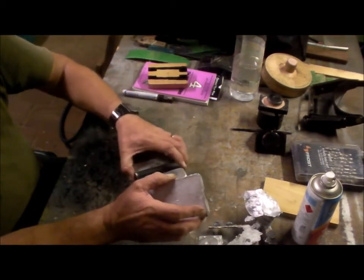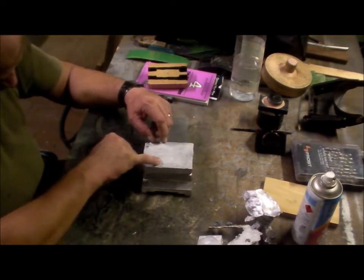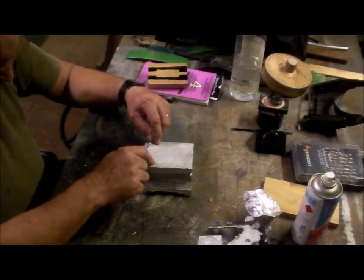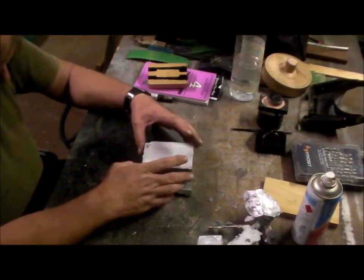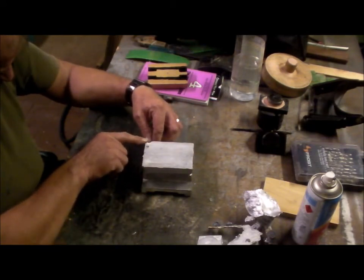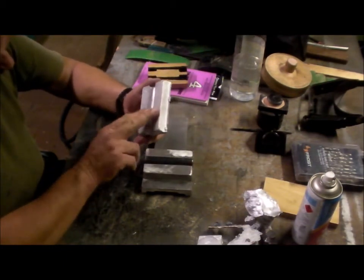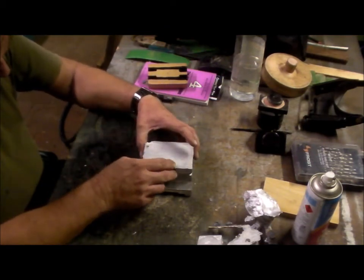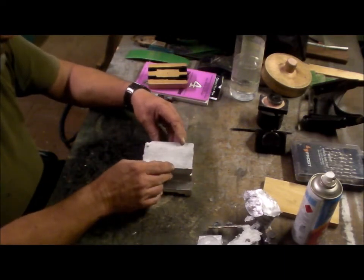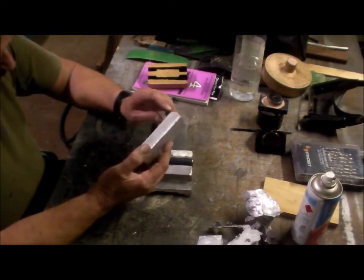And this piece — that's the bearing cap. It has a low point here, that's where one of the bolts is going to be. I could countersink that, but no, I think I'll just do it again. I've got a bit off the corner here that for some reason didn't work. The rest of it is a good fit and has good finish. This will easily cast up — I'll just use the small crucible and I'll redo this one.